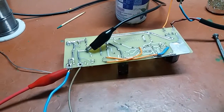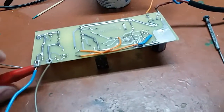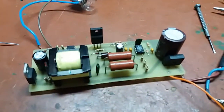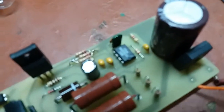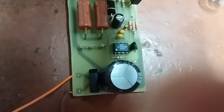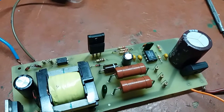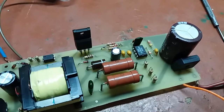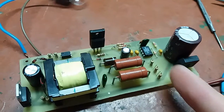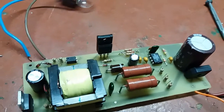Right here you can see my prototype board of a switch mode power supply which is 12 volts and handles up to 3 amps, supposedly. It is made with the UC3842 — it's a nice current mode PWM controller, old as it gets. There are much more modern chips available, but for their price and functionality these chips are great.